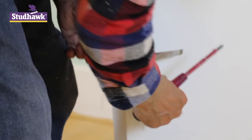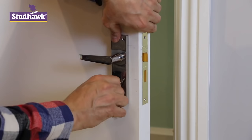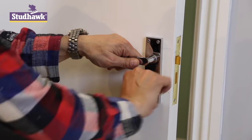Lock. So I'll fit it and just check the rotation of the lock. Again, key in the lock — engage the lock and centre around the shaft of the key. Otherwise the key is going to get stuck when you put it in and out. That looks right on both sides. Latch working, lock working freely.